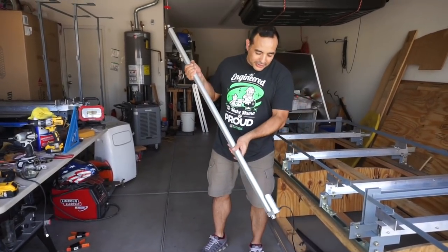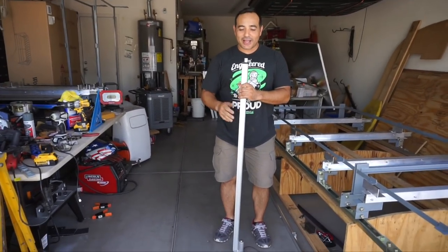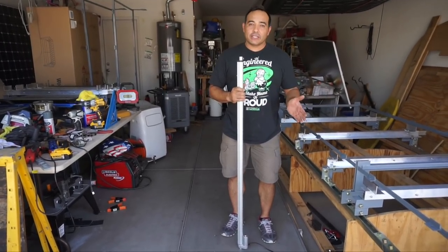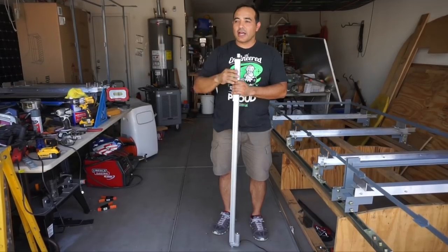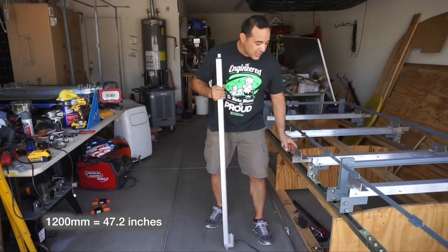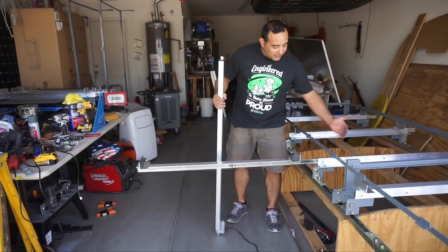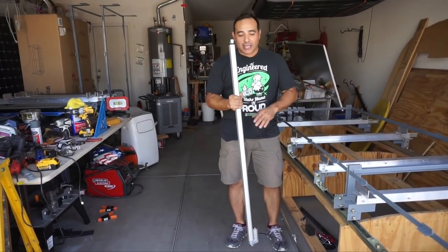In order to facilitate that, we have actually purchased a linear actuator — a really tall one. This was actually the cheapest one we could find. We did look at air systems and we couldn't find anything over about 32 inches. We actually need this to come out over 42 and then preferably somewhere around 45. This will actuate 1200 millimeters, which turns out to be just over 47 inches. That will allow the panel to go all the way out plus an additional 6 inches, giving us that gap we talked about last time to prevent shading from the upper panel onto the lower panel.